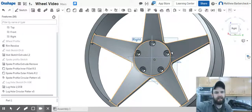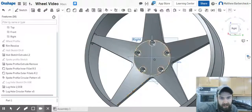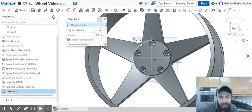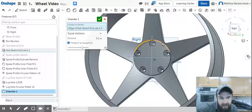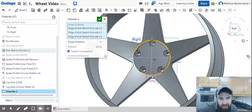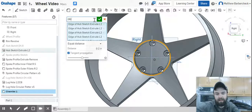Now we're going to add a few cosmetic and aesthetic features to this wheel that we've created. And we're going to start by chamfering the outer edge of the hub here. And we're going to give it a 0.2 chamfer. So select this chamfer and we're going to select that edge there, this edge here, this edge here, this edge here, and this edge here. 0.2 is what we want. And let's just name this outer hub chamfer